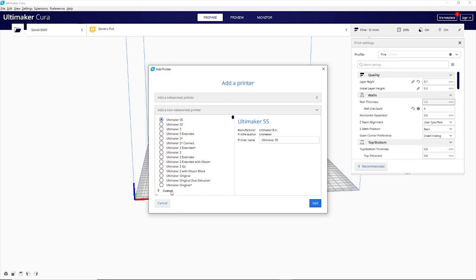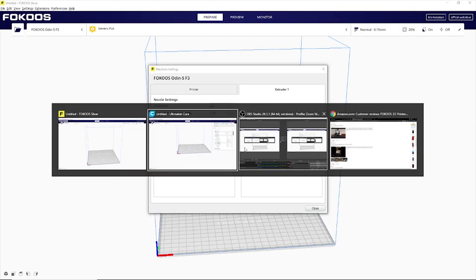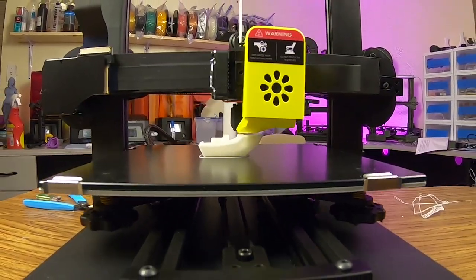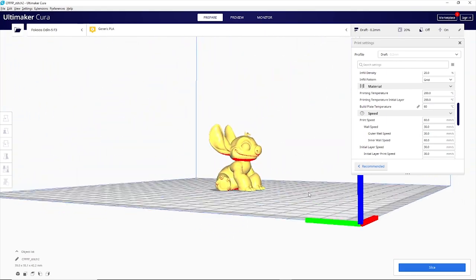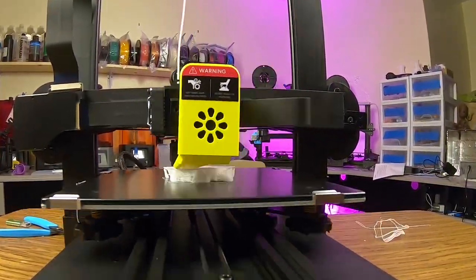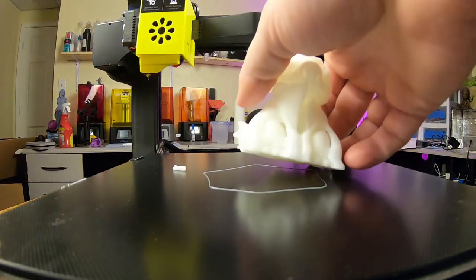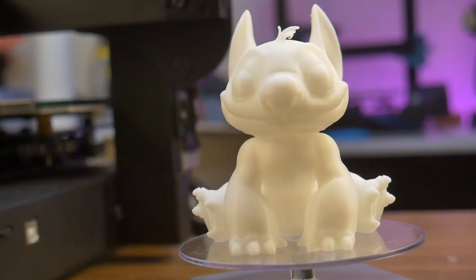When I went into my regular installation of Cura, I could not find a profile for the Focus Odin 5, so instead I created my own profile by copying over the settings from the Focus slicer. The first model I printed was a Benchy benchmark. I had the printer set to 60mm per second, which is faster than what I'm used to. Despite the speed, the Benchy turned out great. I also printed a model of Stitch at 0.15mm layer height just to see how well the printer handles delicate detail. The white filament kind of blows out the shadows and highlights, but in person the print looks phenomenal.